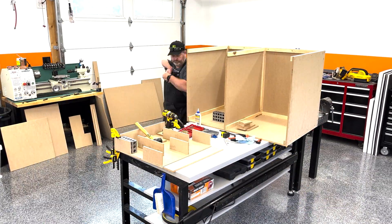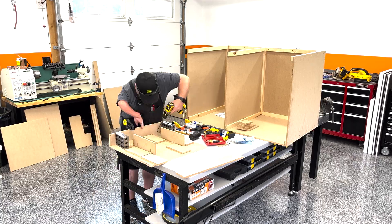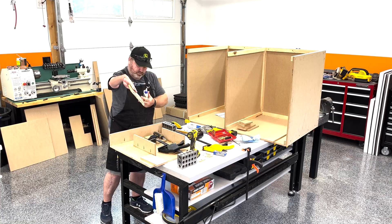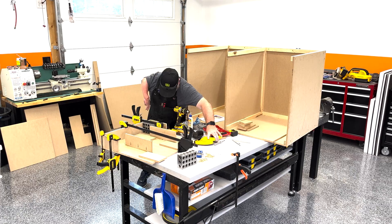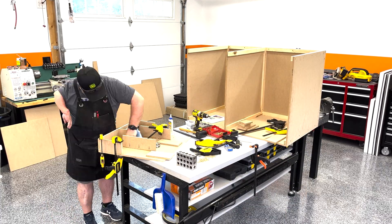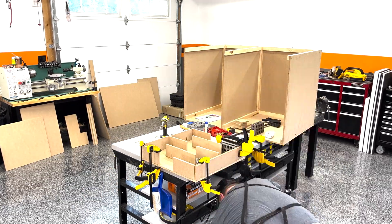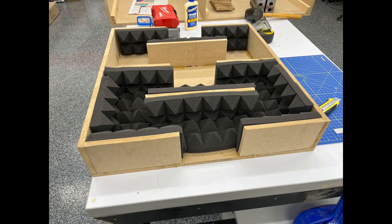Here I'm starting to put the baffle together. This was another challenge because the pocket screws just were not sufficient to hold it, so I decided to go ahead and glue these pieces in — and it turned out pretty good. The glue holds really well, so all the internal pieces seem to be pretty sturdy. Here's the finished baffle — you can see how there is no straight path from the entrance to the exit. And here we're starting to put on the acoustic foam on the baffle.